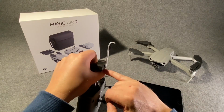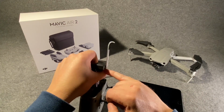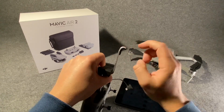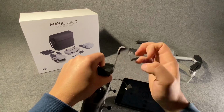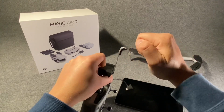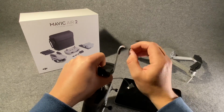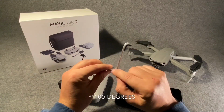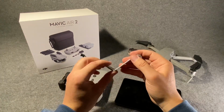It's 76mm roughly from the center of this bend to the first bend up here, and about 12mm then from there out to the edge. And again, these bends, I just put them in a vise and just bent it over until it was close enough. This angle here is about 80 degrees. All right.